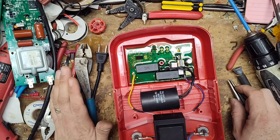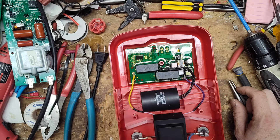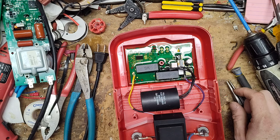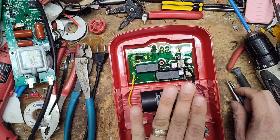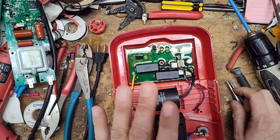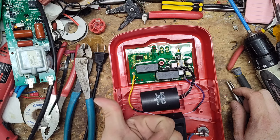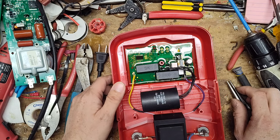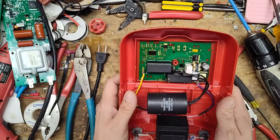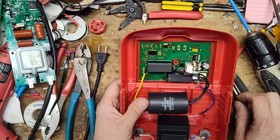The good thing about them is a three-year warranty, but they're not cheap — about $300. There's other three-joule AC/DC, straight AC, or straight 12-volt stuff out there that's cheaper, or some cost a little more depending on the brand, and you'd be better off not spending money on this. Gallagher has a three-year warranty too, costs more, but they're a lot better built and don't have the overheating electronics problem these things do.